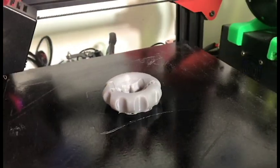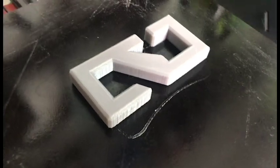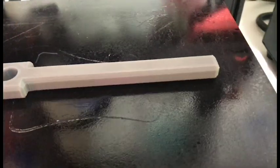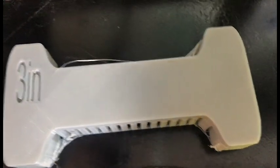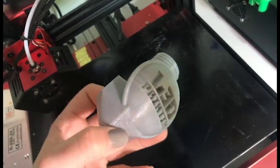The first print, as I always do, is my Maker Coin at 80% scale — just a simple test print. Next we have the strength test, which we'll be pulling apart to see how tough it is. Then there's our retraction test — you can see some stringing, but just barely any. Next we have our bending strength test, which I'll screw into a table and push as hard as I can until it breaks. And then this is our overhang or bridging test — three inches long, and it did pretty well. Next, I took that same model slightly bigger as our support test — we'll tear off the supports to see how well they did. And here is the new little test print for my channel — still in the making.